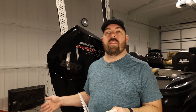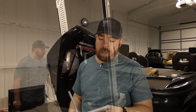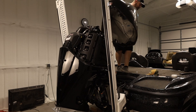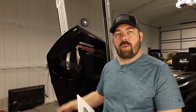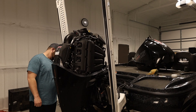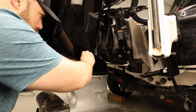First, it wants you to tilt the outboard out and up so that all the oil will drain into the oil sump. It says wait for about one minute. I usually like to remove the cowling and take the cap off the top of the crankcase where I would put oil in at the end. This allows a little airflow to come in and allows the oil to flow a little easier. After a minute, tilt the outboard back to the vertical position and use that five-eighths inch wrench or socket to break loose the oil drain valve, enough where you can turn it by hand.